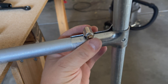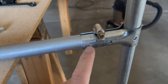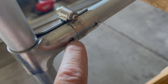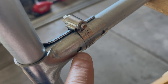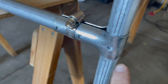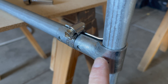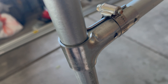I've got this all tightened down where I want it, so it's going to stay in place as I through-bolt it. As you can see, both sides have pilot holes — the only thing is these aren't a true quarter inch, they're about six millimeter, so I'm opening them up a little bigger to fit my quarter-inch through bolt. This bracket was probably intended to just use a tek screw, but I want to through-bolt it. There's no hole on the other side.